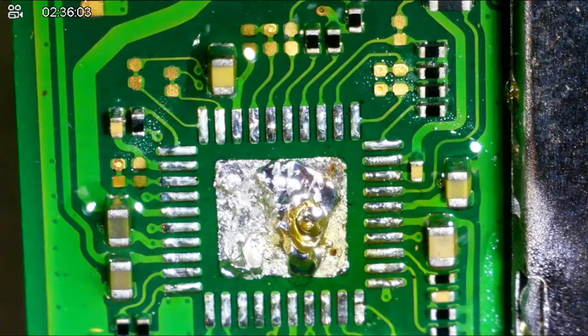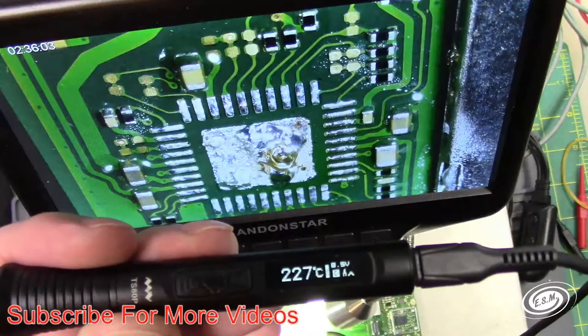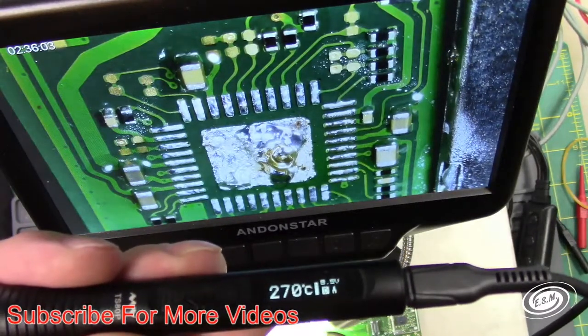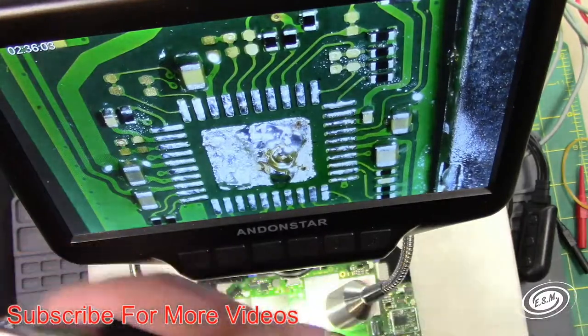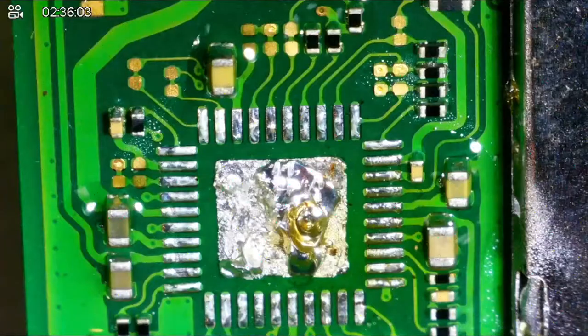I'm going to get my other iron here. I'm going to heat it up. Now this is my TS-80. It takes a little longer to heat up because it's only running at 8.5 volts, but it's got a bigger tip for that ground pad, because it's a pain in the butt to switch tips on my soldering iron.